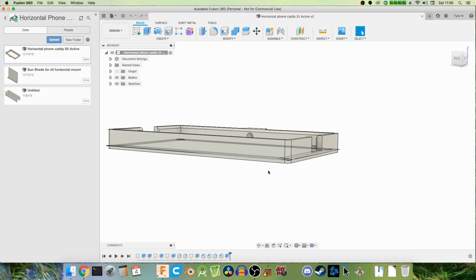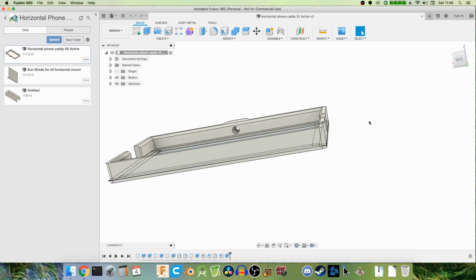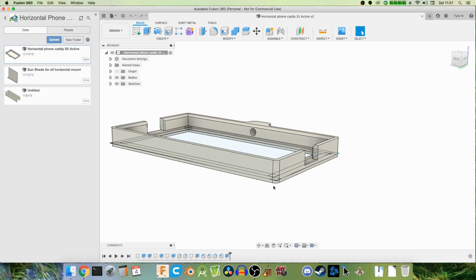Now, recently, I've noticed when I record on this, I don't have the greatest lighting effects. So I intend to change that. What I intend on doing here is adding a flange that sticks out on the side all the way around. I'm going to have it poke out about 2 centimeters, maybe a bit less, and affix some LED strip to it that points down, some really nice high CRI LEDs, so that my subject matter is well lit.